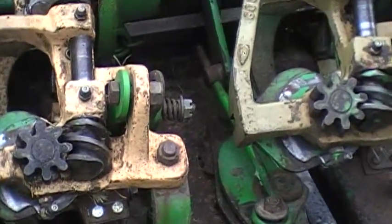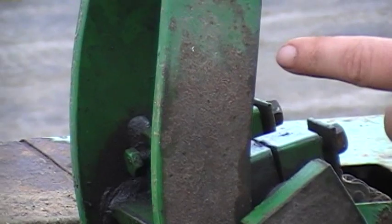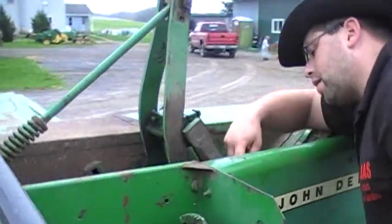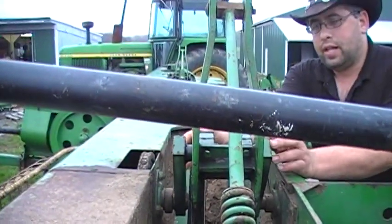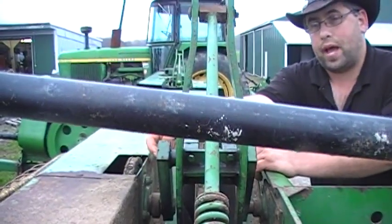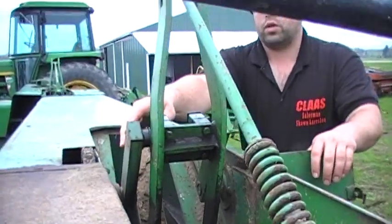As you can see, the person that had this baler did not clean it out. Up here on top are your feed forks and bushings. These ones are loose right now because this machine is being parted out, but the feed forks should be fairly tight and snug. Check both bearings on the feed fingers — front and back — and make sure they're tight. Also inspect the feed forks as they go around; make sure you don't see any steel flexing on both sides. If you do, the crank is bent — that's bad. If you see any steel flexing when this is running on either side, the crank for the feed forks is bent.